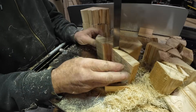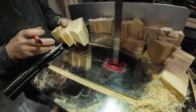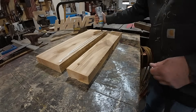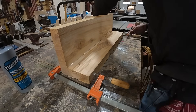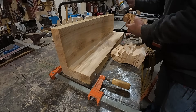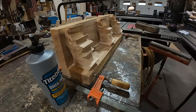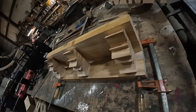They were a little chunky so I cut some airspace out of the back — just improvising on the spot. And there you go. I take it all over and glue it all together with Titebond Quick and Thick. Since this wood was so wet you could see the moisture in the wood, this would take a few days to actually cure. And there you have a shelf all made from one piece of wood — with the help of a great bandsaw you can really get it all out of one chunk.